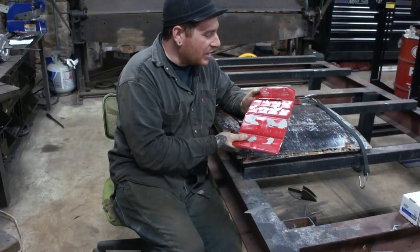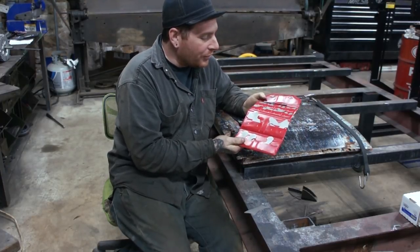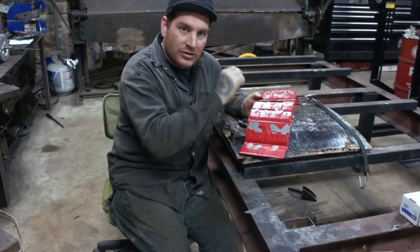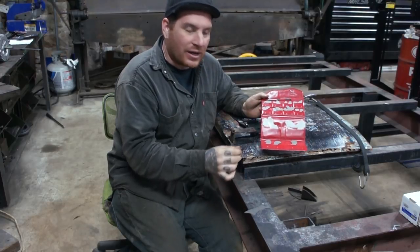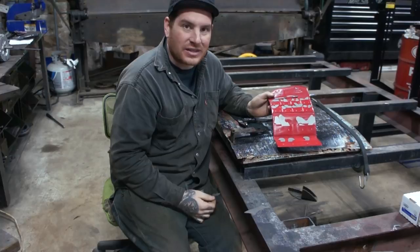So I got this old set of Starrett radius gauges. And these are small little radius gauges. I use a larger one when we're doing panels on a car that you may see me use. But these are small ones. They have real tight radii around them that you can use, and you can pick up small curves and panels and beads and things like that by using this.